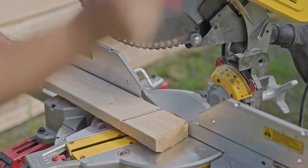So if you go in with one nail weak, and what kind of screw are you using there? It's a 3-inch decking screw. Okay, those are lousy for shear strength. So use that in the middle and then add another nail. You can't use deck screws for structural lumber, okay? They have really weak structural strength, okay?